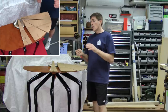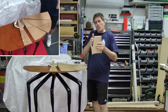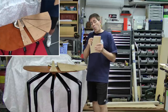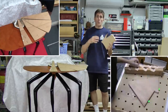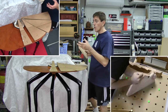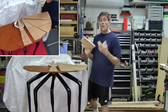We used the track saw to cut all the wedges. One of the off cuts from earlier pieces of the octagon showed the grain flowing straight down the center but cut at an angle — this means you're dealing with a lot of end grain on the cut edges. When applying glue to the wedges I had to apply it, then go back a couple minutes later and apply more because it basically just all absorbed. So all these wedges glued together like this — it's all end grain being glued, which is an inherently weaker joint than long grain to long grain. We have to do something to strengthen that.